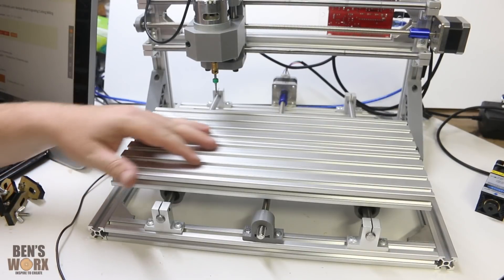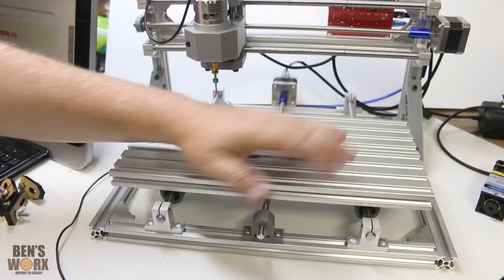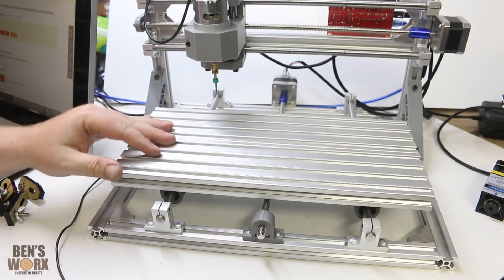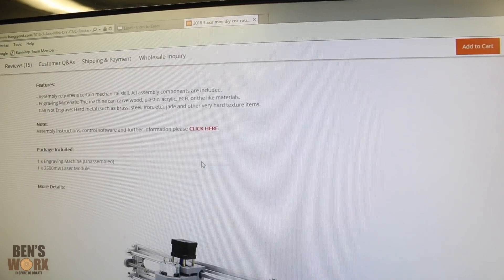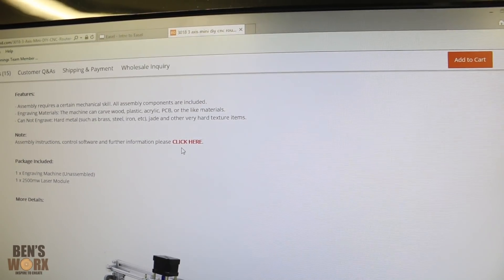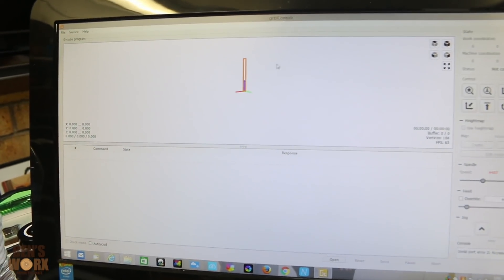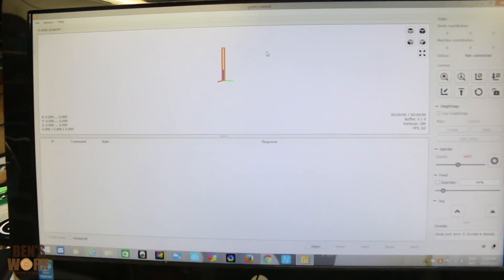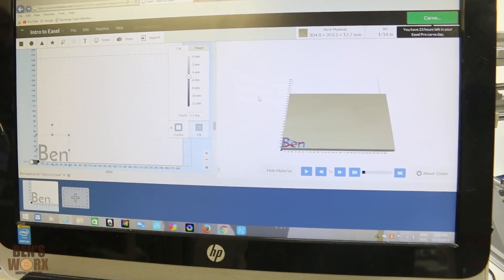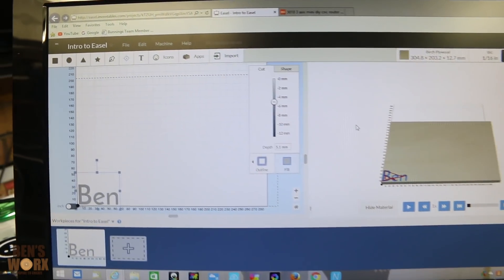One thing I'll mention — before tightening up all your nuts and bolts, just make sure that the bearings slide freely on the shaft. That way you're not out of square and there's no binding up. If you scroll down on Banggood's webpage, there's a spot where you can click to get some control software and instructions. The software they recommend in the download is not very good — I probably don't recommend it. If you really want to get into carving, I recommend downloading Easel. It's definitely a far better program to use.